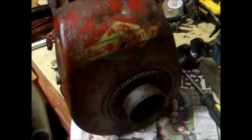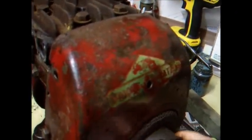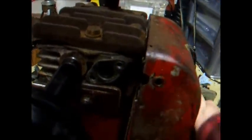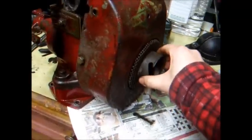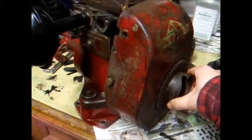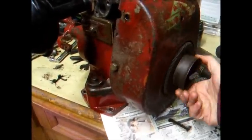The engine's original decal looks pretty nice. The engine turns over with no unusual clonks, just the usual rattly valve train you'd expect on an air-cooled engine, and there's not too bad end float. I reckon the engine is probably from the late 40s, maybe early 50s. On the back of the flywheel there's a letter and number — on the ZZ ignition back plate that indicates the month and year the engine was built — this one has a 52, so maybe it's a 1952 Briggs & Stratton 5S.